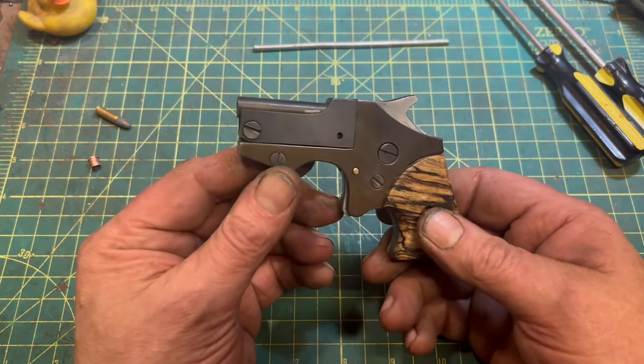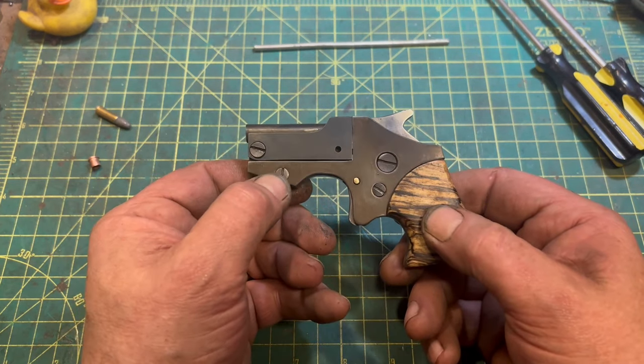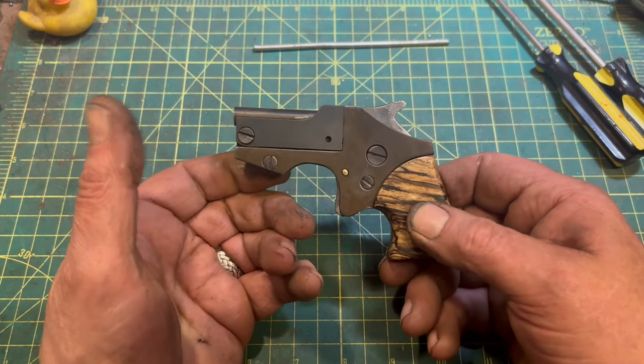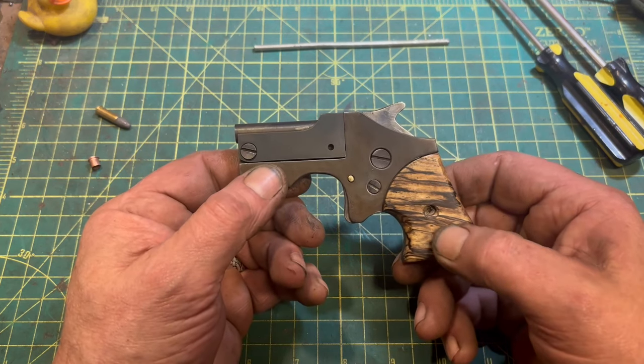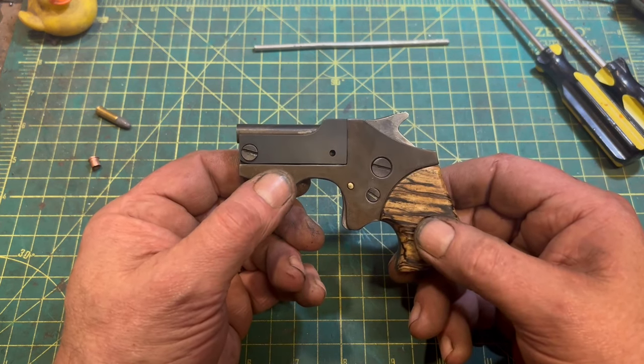And the finish of the gun is very plain. The mechanism of the gun, I'm putting up a picture. As you can see, the mechanism of the gun is very, very simple. There are two springs and two moving parts. And that clothespin spring type arrangement with the loop and the wire looped mainspring is something I've only done once, and I never did it again because it's not that great. So as you can see, like I say, it's very, very simple.